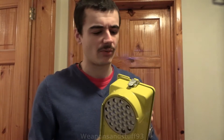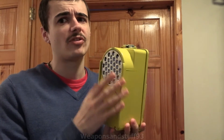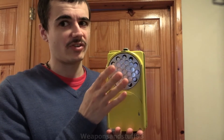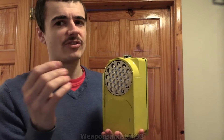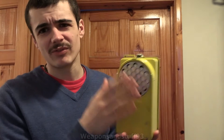This is so that beta energy can more easily penetrate the ionization chamber and give you a reading. However, I expect the main reason they stopped this was — these ionization chamber units with beta windows at the bottom never seem to work all that well. If I get a bit of strontium-90 and put it directly underneath, generally the needle barely moves, even though it's quite a hot piece of strontium-90. I'm assuming it's because beta energy doesn't travel that far compared to gamma rays — even sitting right on top of the check source, it takes a reading in about the middle of the ionization chamber. So it's a distance thing.